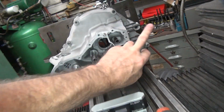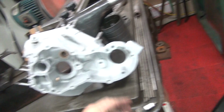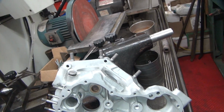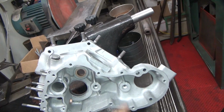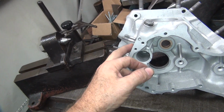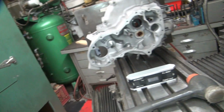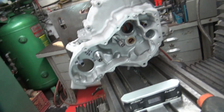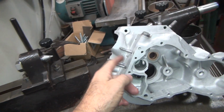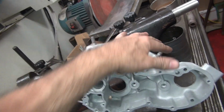The oil pump's surface is rarely ever damaged, so that's an excellent reference point. The cylinder decks have been cut a lot, and they vary from case to case. I know lifter blocks vary quite a bit, so back to this. This should be a good reference plane. That should never be screwed with, so if you're going to start from a 0 point, start from something that doesn't get modified. Nobody ever cuts that surface. Nobody. All these other surfaces I've seen cut, modified a lot.